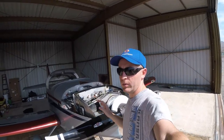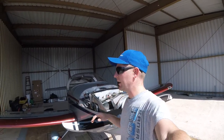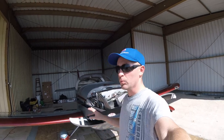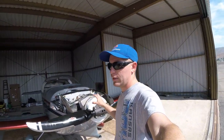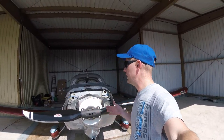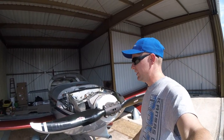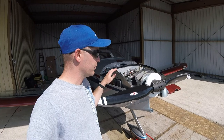With this prop climbing out at a lower RPM of about 2,200 to 2,250 at max gross weight, I can still get 500 to 800 feet per minute on pretty much any given day, unless density altitude is maybe 7,500 or 8,000 feet and above — which is still really great for 150 horsepower on an O-320. This prop has been great because the 150hp O-320 is a bit underpowered at high altitude, so anything you can do to better climb performance and efficiency is valuable. If I wanted a slightly better climb rate I could go with the number zero pitch setting, which would probably increase my RPM by maybe 40 or 50.